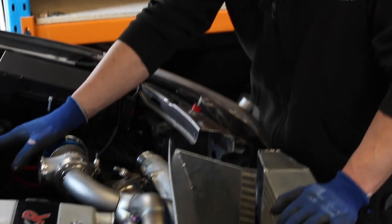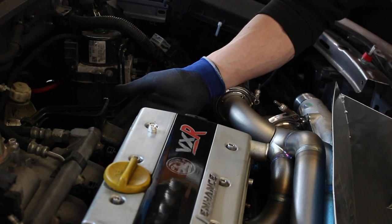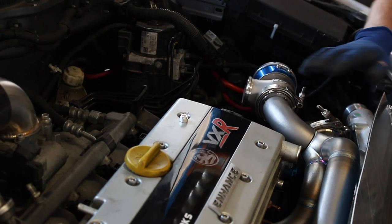We've got a few things to think about. We've got to get the downpipe all the way over the back of the engine, down under the subframe and steering rack. Obviously we've got the wastegate to tie in as well. We want to keep it as far away from the brake lines as possible because we don't want to heat the brake lines up, and we've got to keep it as far away from the inlet manifold as possible because we don't want to heat the charge air that we've cooled down through the intercooler.